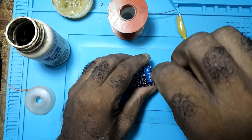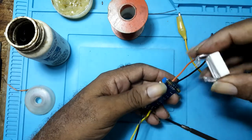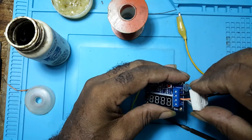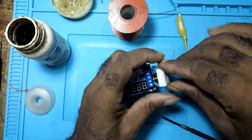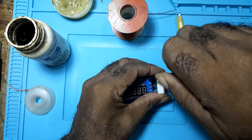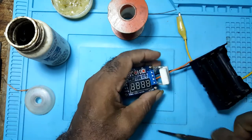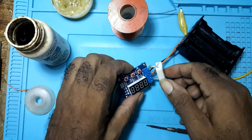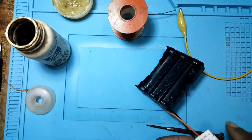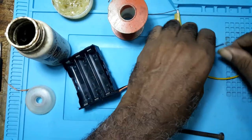And you'll also tighten it. Then you'll put your two resistors. The resistors don't have any special way of going — they don't have a plus and a minus. And you'll screw it down. When you do this, don't let the resistors touch the wire, because the resistors do get hot and it would melt the wire.